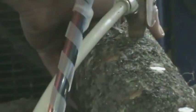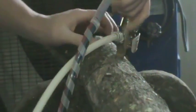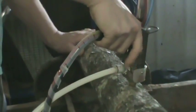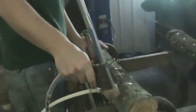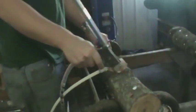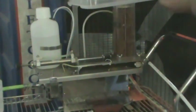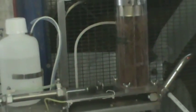With the semi-automatic gun, a simple press of the trigger fills the inoculation site and seals it with a styrofoam cap. The operator has checked the spawn fill rate with his finger to make sure it is properly filled, and it certainly is. Spawn from a reservoir is shot through a tube at high pressure into the drilled hole. The inoculation rate is about one hole per second, and fill rate is dependent upon the operator's hand-to-eye coordination.